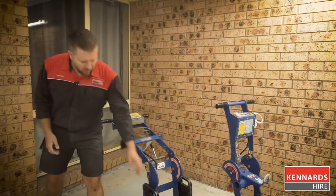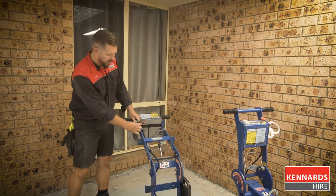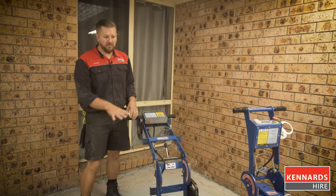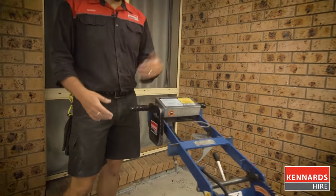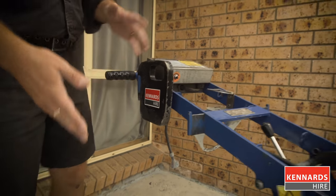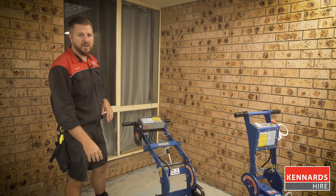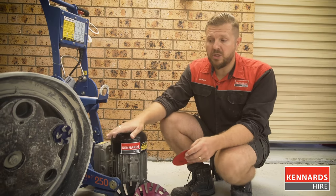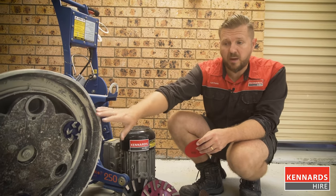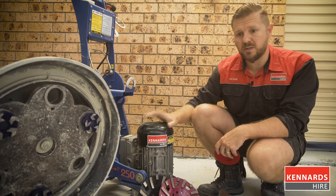To help with that, we've got these adjustable weights — they'll move depending on the surface you need to do and the step in the process that you're grinding. Moving the weights higher up the handle obviously takes a little bit of weight and pressure off the grinding head. So a single head machine such as this one actually uses three plugs or three discs at one time, while a small machine like this just uses the one disc.